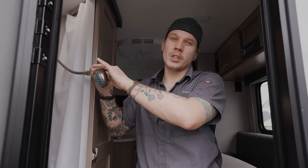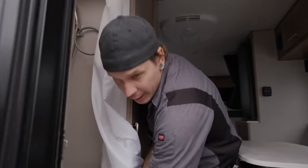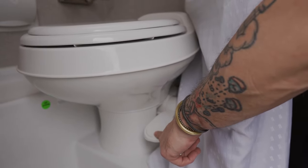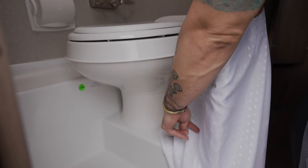As mentioned, the water heater is only six gallons, which doesn't translate to a very long shower. Most customers take military or navy-style showers — cutting the water flow on and off multiple times — and the on/off switch at the fixture helps with that. For the toilet, there's a pedal flush on the bottom. A light press feeds water to the bowl — it's a good idea to keep some water in the bowl to keep bad smells down. Press all the way to the floor to flush.